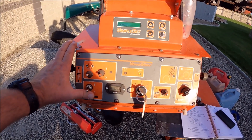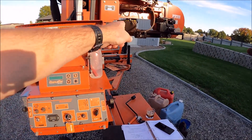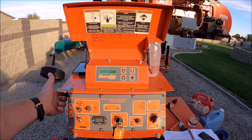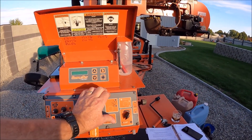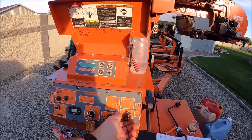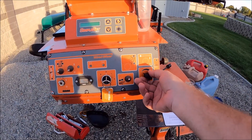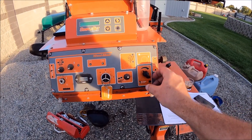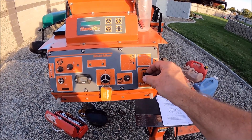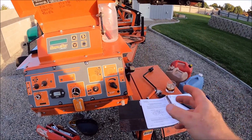For those that don't know: you engage the clutch, turn this on, hit the clutch and the band starts spinning. Kick it into forward, turn the debarker on if you need it, adjust your guide arm, then turn up your speed control. With softwoods I'm usually running about 11 o'clock — so if 12 o'clock is straight up, 11 o'clock is right about here, maybe 10:30 to 11.